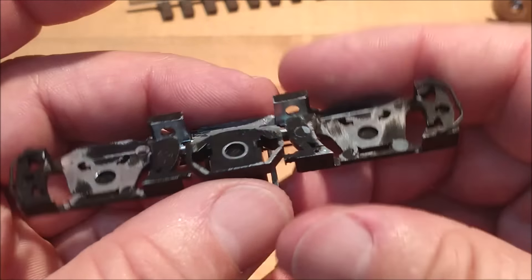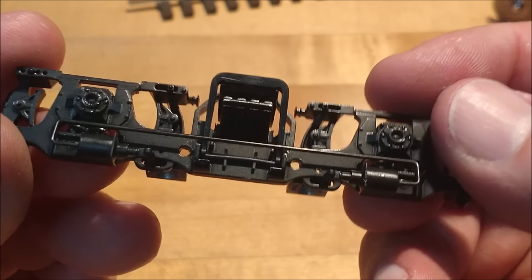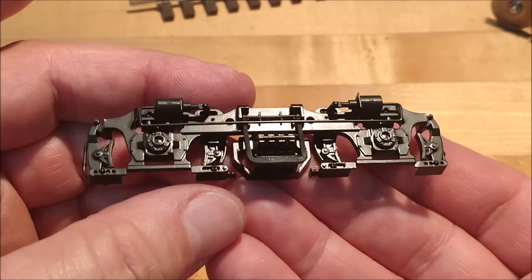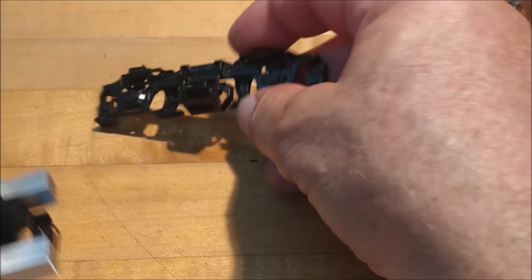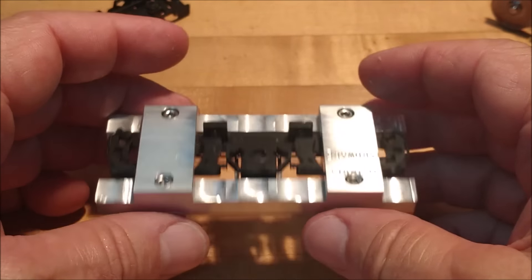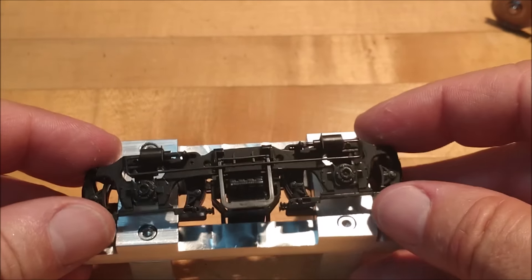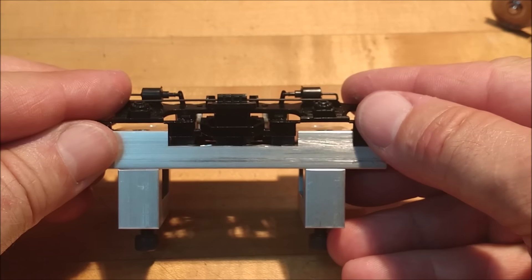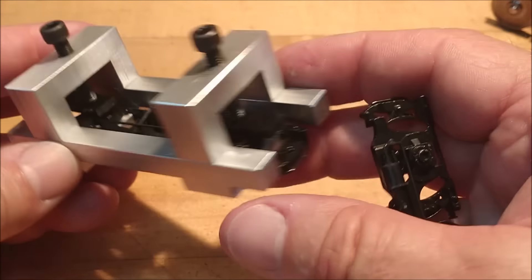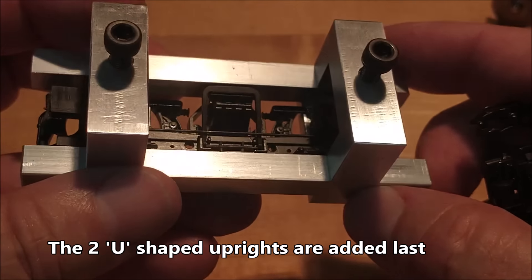Let me show you what I came up with. You need to hold this piece upside down when you put it in the machine, and you can't squeeze it because you'll crack it. This is a very fussy piece — one of those where you spend way more time on the fixture than on the actual machining operation, and it's got to be repeatable. Here's the fixture. It's an inverted nest and it's relatively easy to make. Pick your contact surfaces and mill a positive on your block for those contact surfaces — that will fit right in there. Then flip the block over and knock the center out, so those positives now become nests at the bottom of the trough. And you can see how the part sits in there just perfectly.